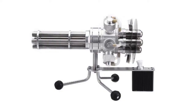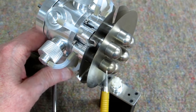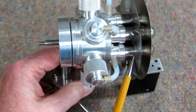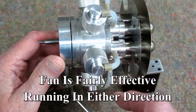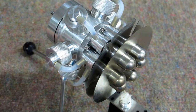This is a six-cylinder rotary Stirling engine which looks and sounds like a Gatling gun. This is a heat shield. Its job is to keep the fire from heating any more than just the end of the tube. And then this is a fan. These tabs push air and blow it across these cylinders to keep them cool for a bit longer so the engine will run for a bit longer.